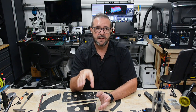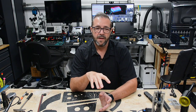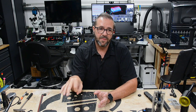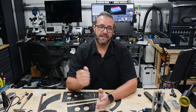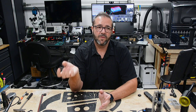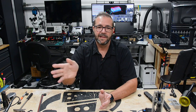So the inspection and the collection of data is something that wasn't previously possible by the HDM. But given the UCCNC and the AXBB, there's functionality to collect probe points and store them in a file. Some of that configuration setting is in the UCCNC settings page, and that will, on G31 commands, save the probe position in a text file, either comma delimited, you determine the number of axes that you want to collect, and all of that important information.